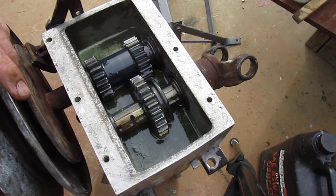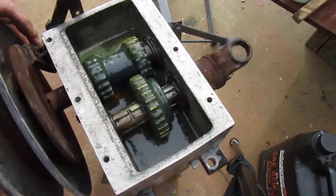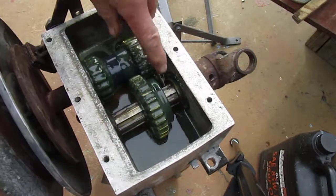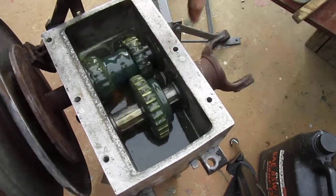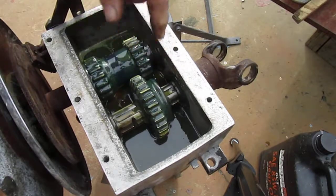The problem is the oil never reaches the bearings when this thing is in motion. This is the direction the motor would be turning — the oil is thrown over into this area. Before I kept adding it, these bearings just ran dry. No matter how many times I turned it or how much I spun it at what speed, these output shaft bearings stayed dry.